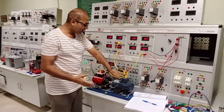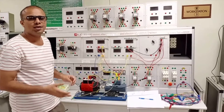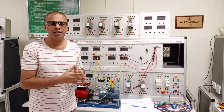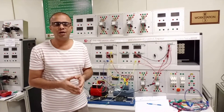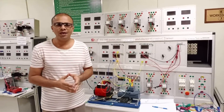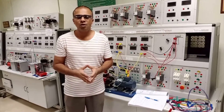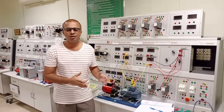To repeat: this is the experiment of the DC series generator, in which the armature winding is connected in series with the series field winding, so the whole load current of the machine is carried by the armature winding. The ammeter is connected in series with the armature winding and the series field winding, which has fewer turns with thicker wire to carry the whole load current. I hope you understand today's experiment. Please subscribe to the YouTube channel for more interesting videos on electrical machines.